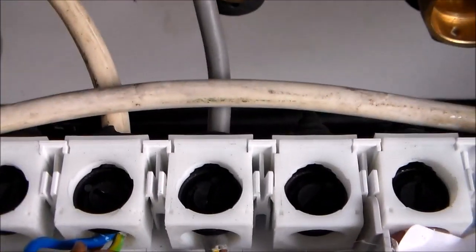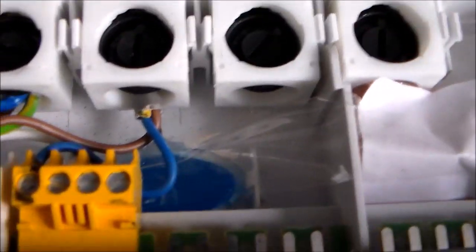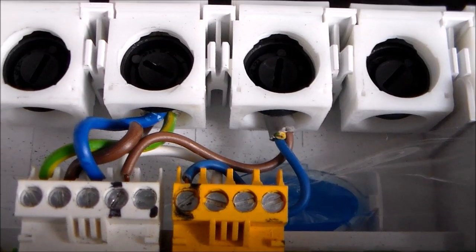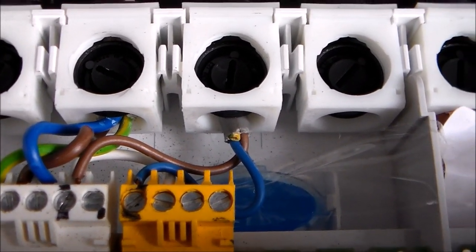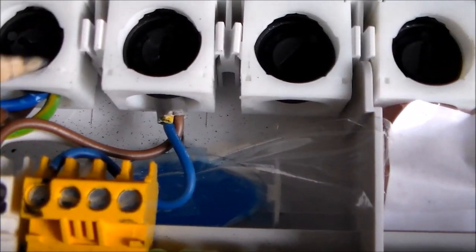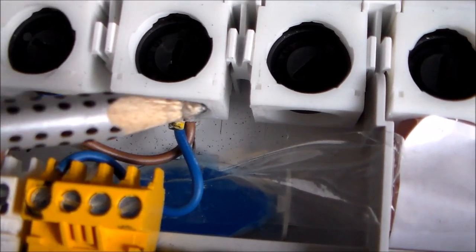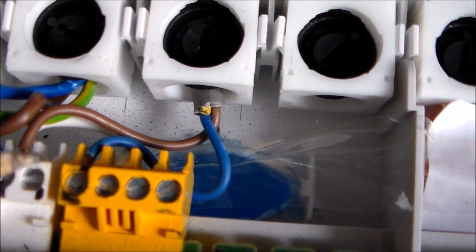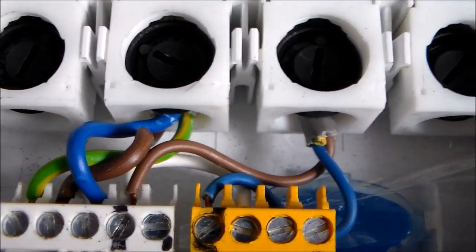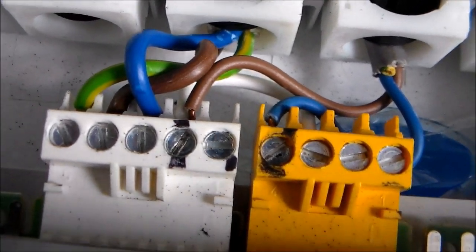Those two wires which are coming in on this grey sleeving, I'm going to need for my 12 volt supply to the thermostat, and the thermostat will be in the same place. So that cable that's in there will be taken out and also connected into the Nest and used as the 12 volt feed. I've got a pencil so I can point to them. The previous live out and live return from the old thermostat came down here. That's going to be taken out and disconnected and used to supply the 12 volt. So none of the mains in wires on the white block are going to be removed. They're going to stay exactly where they are. The mains input is going to stay exactly as it was.